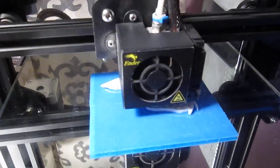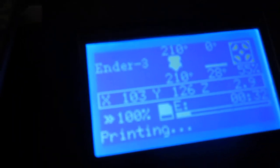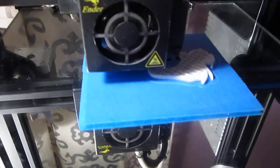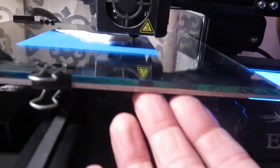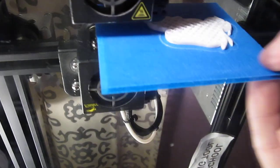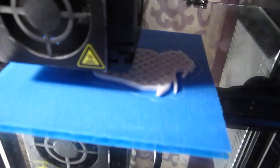This is my setup. You can set up your printers any way you find works for you. Also — no heated bed. The set point to the bed is non-heated. Nozzle is 210°C; I use 210 for the PLA, that's what we're printing. They say, why can't you just heat the bed? Because I don't want to spend extra energy and extra time heating and cooling and worrying about a warped bed because the heated bed is causing the metal plate to warp. You can use the purple Elmer's glue stick. As you can see, there's no curling, no warping — it's flat to the bed and will remain there through the entire print.